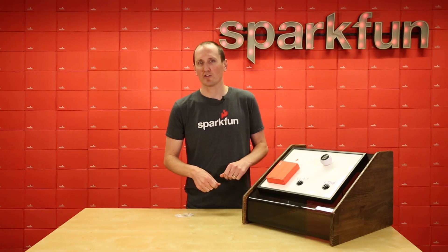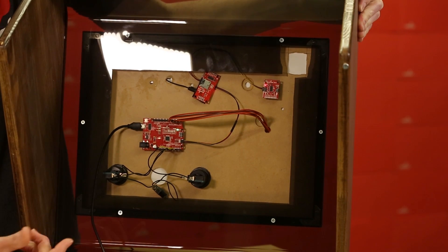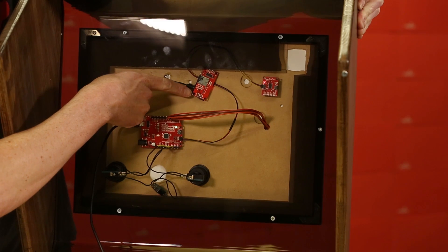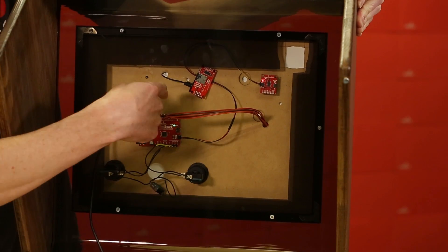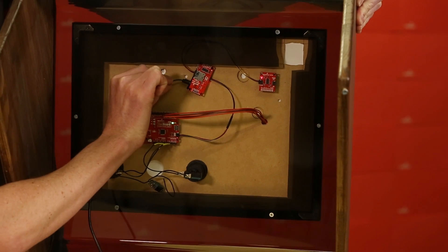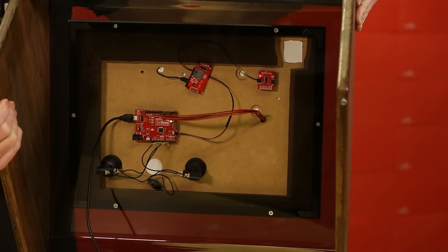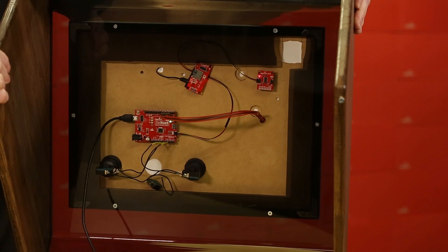Let's turn this around and look at the electronics inside. It's laid out pretty nicely — there aren't too many cables. We've got our RedBoard Qwiic here central to the faceplate, and then I've got my Qwiic MP3 player wired with a single Qwiic cable that provides power for all the boards and communication to the MP3 player. The MP3 player is wired to a little hamburger speaker, and the Qwiic cable passes through to the RFID reader in the corner — providing power and communication to that board. Super easy hookup.